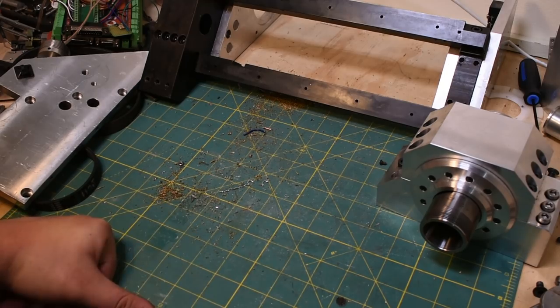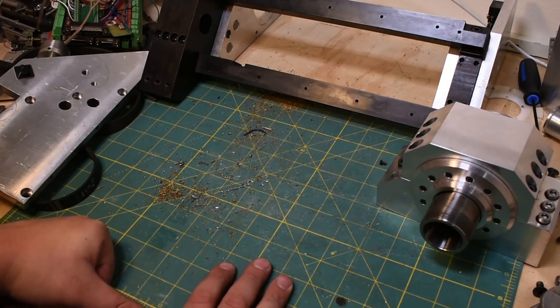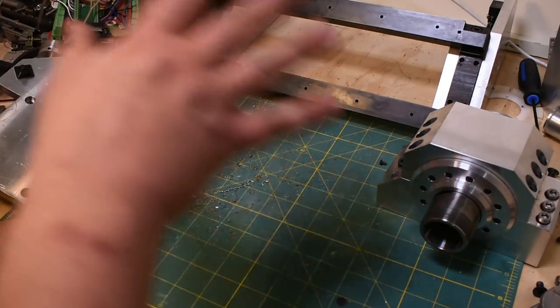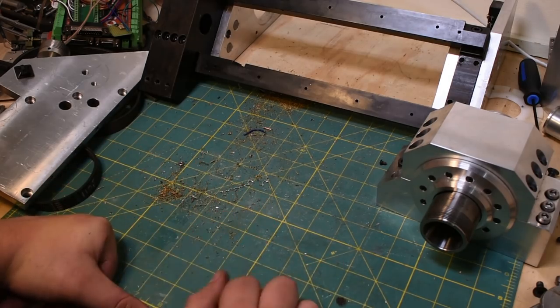The steel frame worked out well, although I kind of appreciate now why machine makers will cast machines out of larger pieces of material. Casting, of course, being cheaper, and also there's a lot of real estate you've got to cover. So making it out of solid block, even at this size, is kind of impractical anyways.